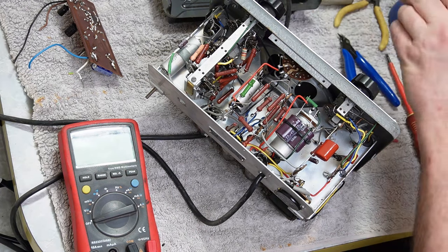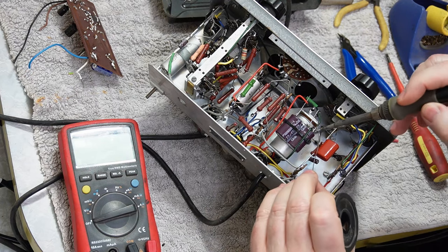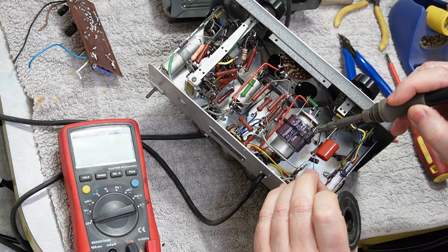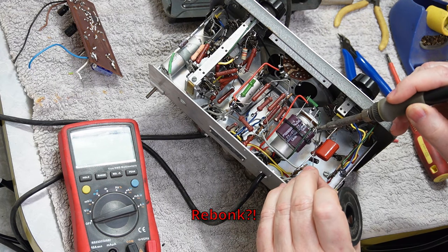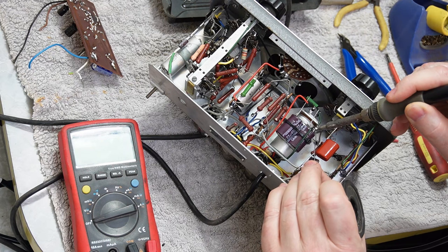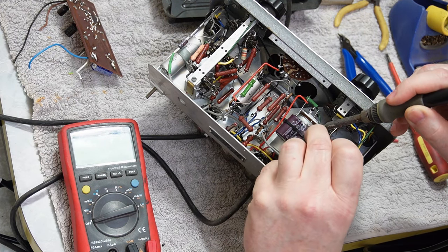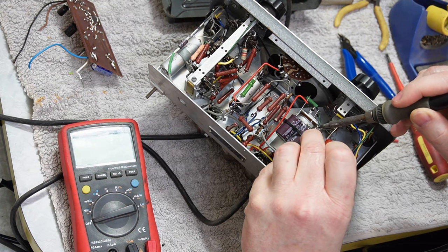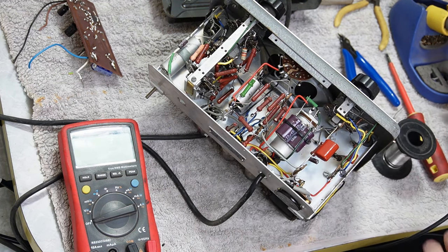I was not a happy camper at all, but luckily I was able to get the wire back in and re-bonked the staple into it, and then I remelted the wax. And all was good. And in fact, that radio goes blooming well for a little 5-valve from 1933.